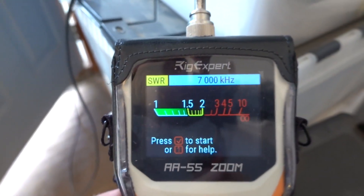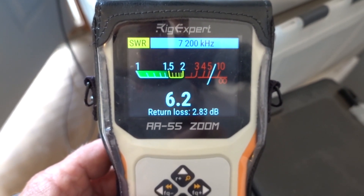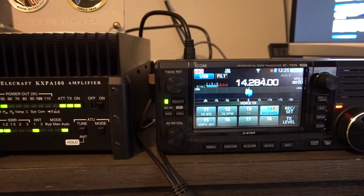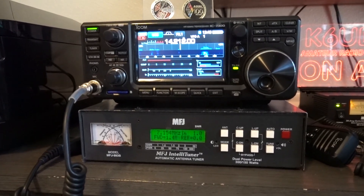40 meters is not happy here — it's resting on that antenna at about 7:1 SWR. The internal Icom tuners won't handle anything much more than a 3:1 mismatch, so the 7300 wasn't doing great on 40 meters. Last weekend I was playing in the Idaho QSO Party and I used the IC-705 with the Elecraft amp. I ran the entire contest on the 705, and right after it ended I remembered I had another tuner sitting here — hooked that up and the 7300 is happy now.